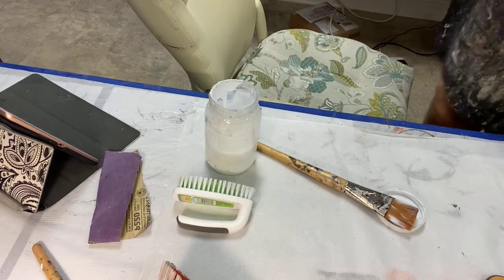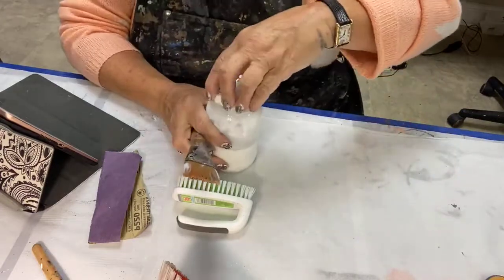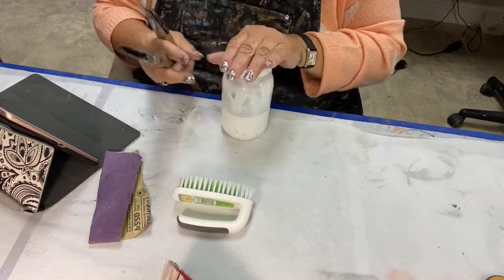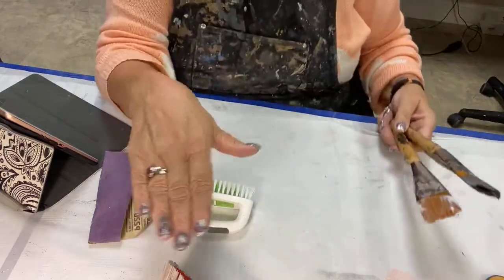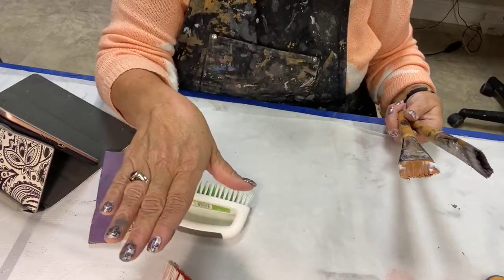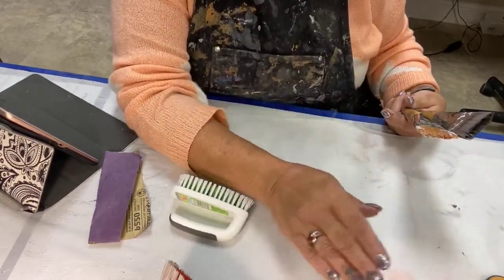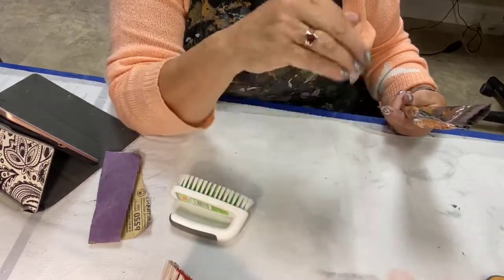You see, when I put stuff in a hot box like that, it's like putting it in a warm, extra warm room. It's not super hot. It's not like putting a hair dryer on it, which becomes problematic because that heats up the top of something. So you've got a hardened surface over things, but then it's like a pudding. You've got a skin of hard stuff on the surface and everything underneath is wet. Whereas what I'm doing with a hot box is just raising the temperature of the whole area a little bit, and that speeds drying all the way through.